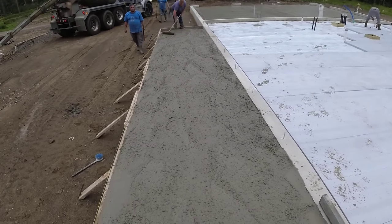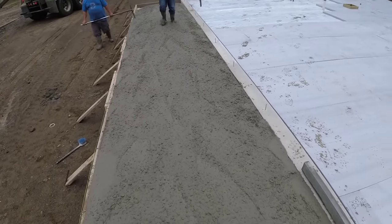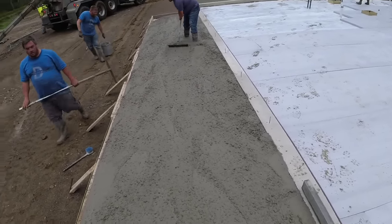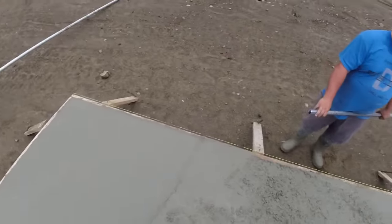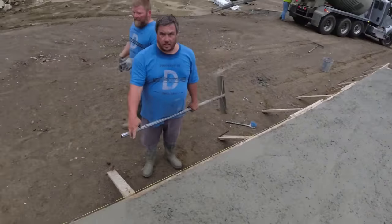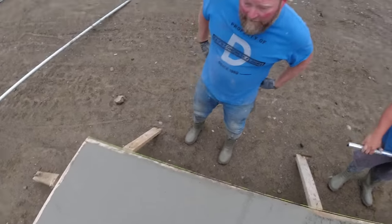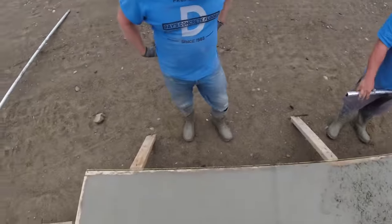So we can't get a balance truck. He's too busy today, so we're gonna have to drop this down about 1/4 inch probably to fill that last little piece in over there. I got as much concrete as I could on both trucks, hoping it would do it. I think if we match the chamfer, we're gonna be shoveling 1/2 yard out, but thinking of just dropping this 1/4.